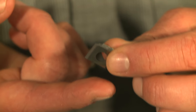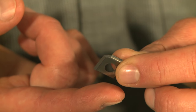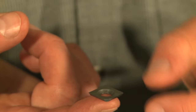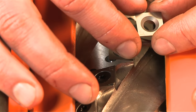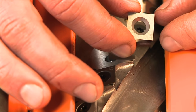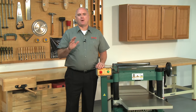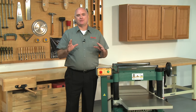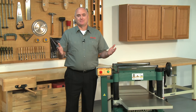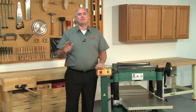Also, if you happen to hit a nail, a staple, a small stone, or some other foreign object embedded in your wood, you only need to rotate a few broken inserts instead of having to replace a whole set of regular knives. When the cutter heads finally get dull, changing them simply requires turning all of the inserts 90 degrees and you're back in business. With four cutter edges, the original inserts can provide years of service before any replacements are needed.